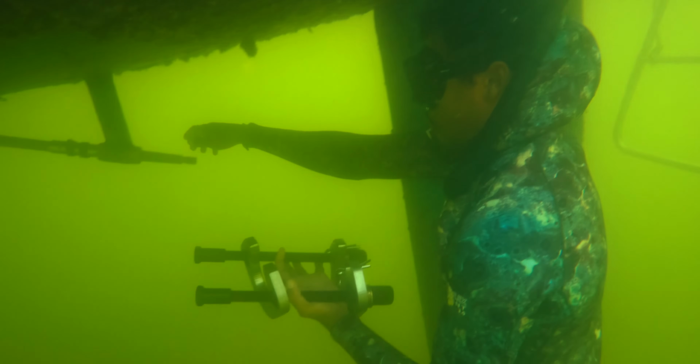So we got the new cutlass bearing back in. Now it's time to disassemble the tool and get the prop back on, make sure everything spins smoothly in there, hopefully there's no more grinding, clean the shaft, get the zincs on, and we're off to the Bahamas finally!